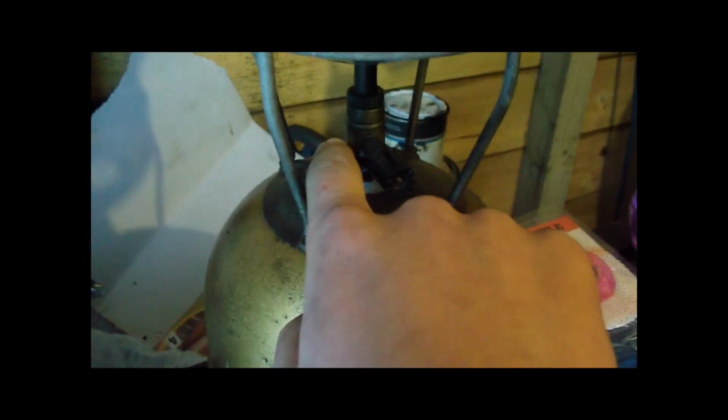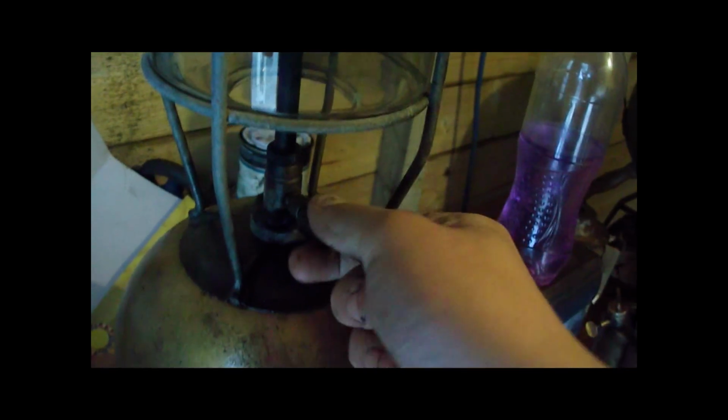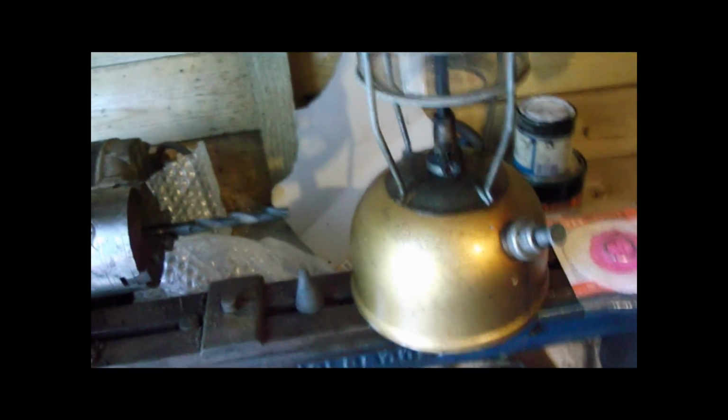It does leak under there. I did put a tap washer in there, but it melted. So I've got these few fibre washers. I'm not sure if they'll fit or not. And also the gland washer inside this adjustment control leaks as well. So in this update, I'm going to strip this one down and give it a good clean up and see if we can get it going.